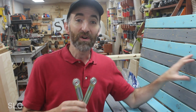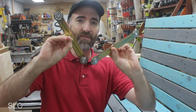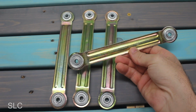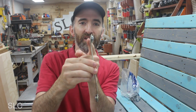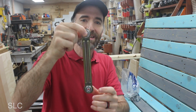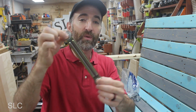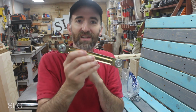Now if you're going to be converting a swing into a glider or just building a glider, I would suggest first finding the actual hardware. These are the swings that you can use to make a glider. Now it's a little hard to see, but these are offset a little bit. That is so one side can attach to your base and one side can attach to your swing and they don't interfere with each other. So I'd suggest finding those first. I'll put a link to these in the description just in case you're interested.